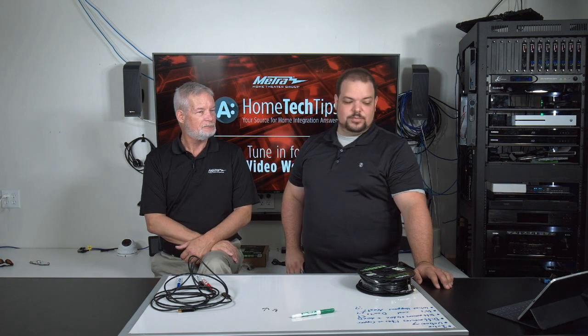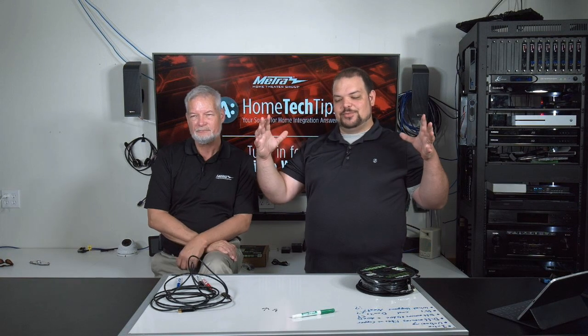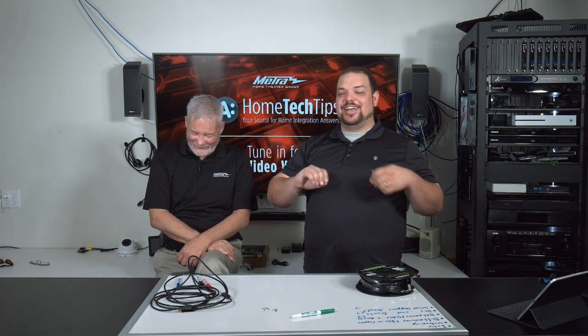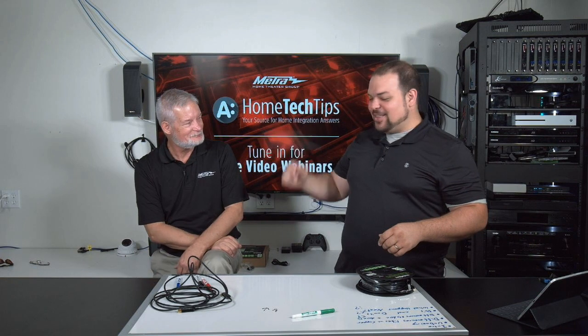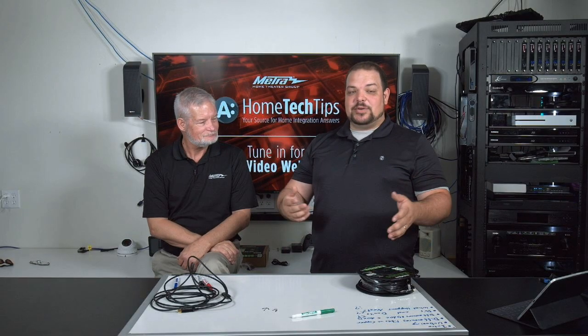Yeah. So really and truthfully, we're big proponents to run tubing. Sorry, conduit's the word. Adam, thank you. That's the word I was looking for. Run conduit. It's really the best way to do things, because then you know that you can run something else in there if you need to. It can get a little tight if you run something a little bit too small, but if you can, go a little bit bigger. That way, if you run a cable backwards, it's conduit. You can pull that back through and run it back the other direction. You can always use the old one to pull a new one.